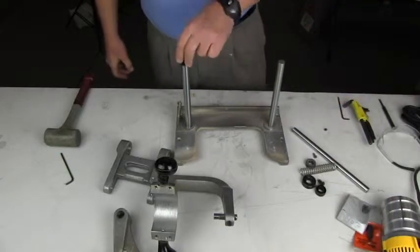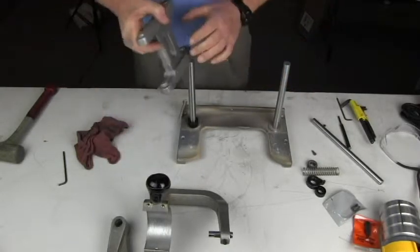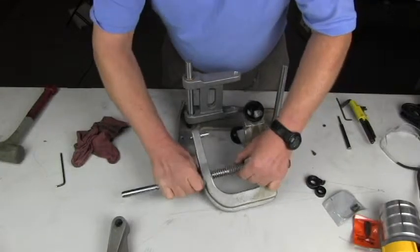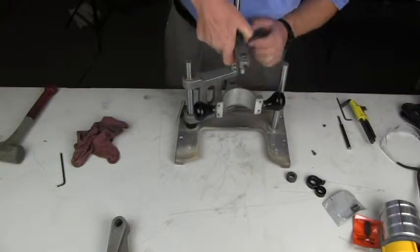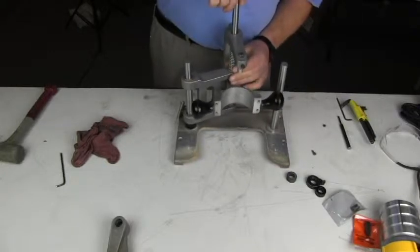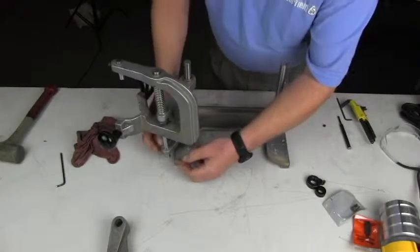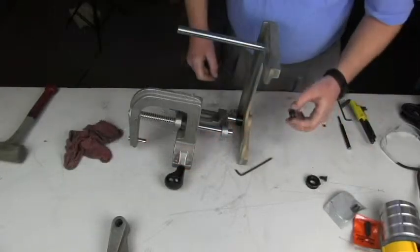Install the spacer on this rod here — the spacer goes all the way down against the base plate. Check the hinge casting to make sure that it operates the shaft in the router casting. That will need to go over this casting. Do the upper hole, install the collar in there, and reinstall the bolt in the lower casting and the hinge casting to hold that pivot pin in. The new pivot shaft is slightly longer.